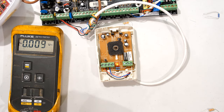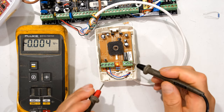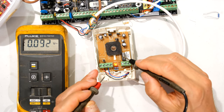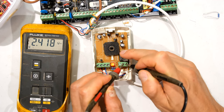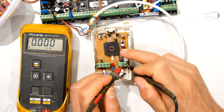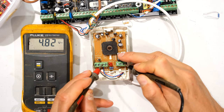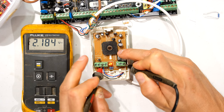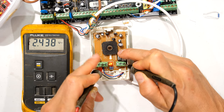Now what happens if a tamper is connected? In this case the wiring is different because a tamper resistor is added, giving an additional voltage. Measuring across the zone I'm getting 4.8 volts even though the sensor is not activated — and that's because of the tamper. The tamper is simply a switch that when closed becomes a short circuit, shorting out the wiring onto the two resistors. So when I measure the voltage, I have to depress the tamper switch at the same time — then I get 2 volts.